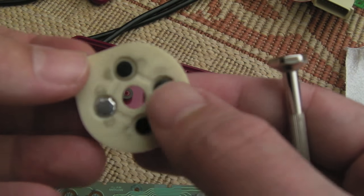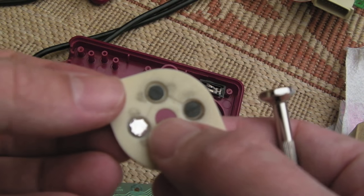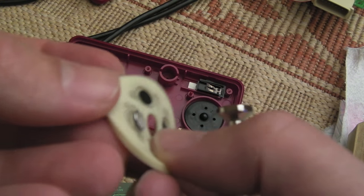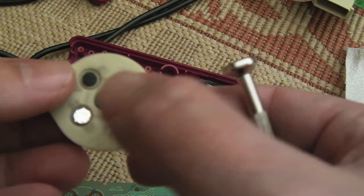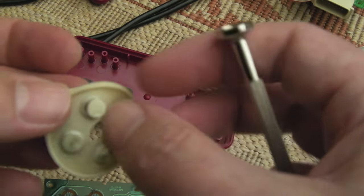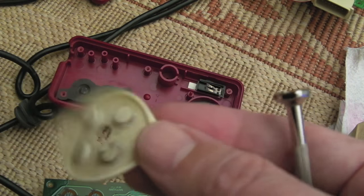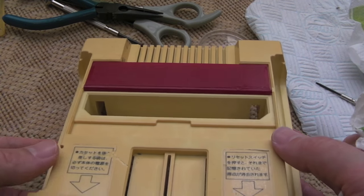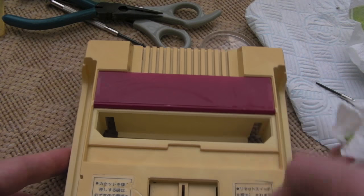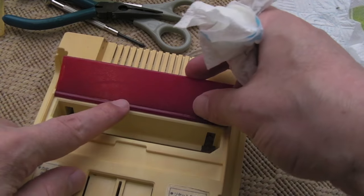Interesting thing I didn't mention before: it's got an aluminium heat sink on top of the PPU with 2C02E stamped on it — I've never seen that before. Whether they added that to some of the later PPUs or not, I'm not sure. Still a bit dirty, this board — I've cleaned up most of it, there's still just a bit of dirt in small crevices. So I'll have another go at that later when the SRAM arrives. I think I'm going to socket up the SRAM — I don't think there's enough space for a socket there because of the plastic that comes around the cart edge, but here there can be a socket.